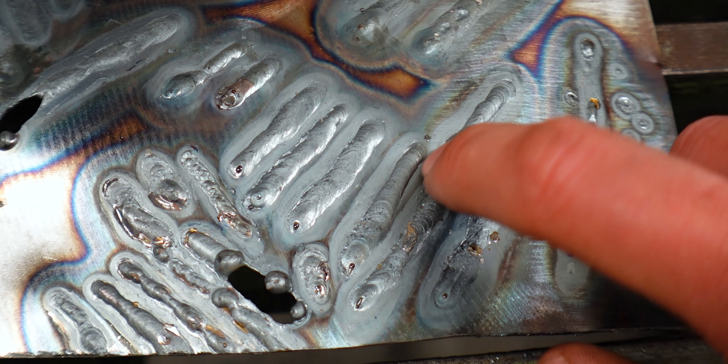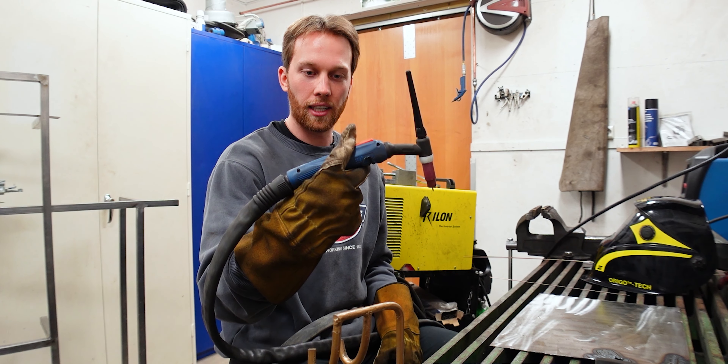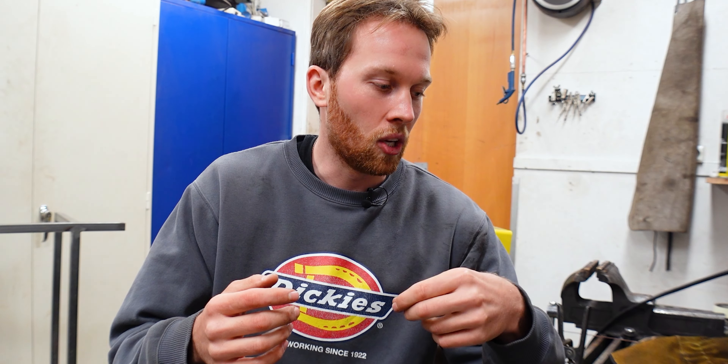It's going okay. Some are really good, at least from what it feels like, and on some I still get hung up with the filler rod or burn through the metal. Let me recap a few things that helped me. Holding the torch like a cigar and balancing it on the back of your hand helped a lot. Holding the filler rod the same way is also nice. Keeping the filler rod close to the weld puddle so it melts easier was helpful, and going a little bit slower let me control the weld puddle much better.